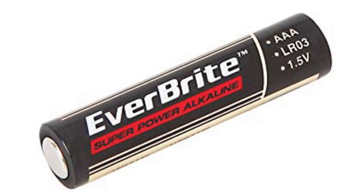How do we pair that to battery? If we're using 20 kilowatt hours of power in a day, we need battery power big enough to take us through the night when there is no sun. You need to measure what runs at night — your refrigerator is running. If you can keep some of the higher-draw loads away from the dark hours, it can cut down the size of your battery. You need to find out how much power you need for the night, because that's what you're storing. In the day we charge up, then store for the night. When I was aiming to deal with about 18 kilowatt hours a day, my battery bank had a usable capacity of 10 kilowatt hours — enough for about three nights when I budgeted it out, because I didn't need much at night. We need lighting and we need to keep the fridge running.